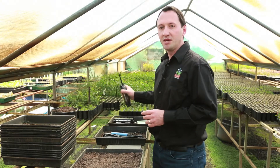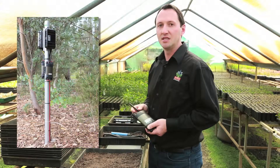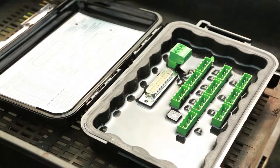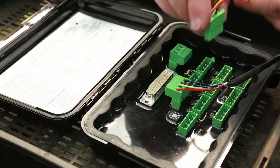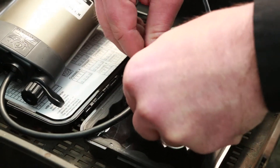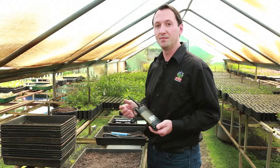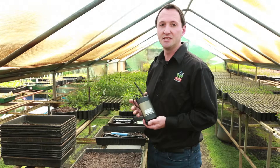The MP306 can also be connected to the SMM soil moisture meter. The SMM can support up to 10 MP306 sensors and has been specifically programmed to support them. This is a plug-and-play system — all you need to do is plug the sensors into one of these ports here, connect the logger body, and then connect the power supply to the logger body. Once everything is connected, simply use the Windows instrument interface to set the logging interval and that's it. The SMM soil moisture meter has a micro SD card which can store many years of data.